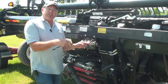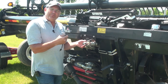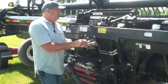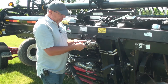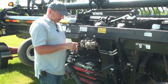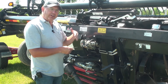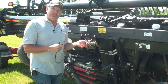If you've checked your actuator and it works fine, you connect the harness at the actuator, run up to the cab, and it's still not functioning, you'll want to check the connector where the header attaches to the combine. It is a four-pin connector and you'll use the same principle using a jumper wire — we can test in the same way. And we know that our harness from this point on and our actuators are working. The issue is either in this connection on the combine harness or in the switch kit itself.